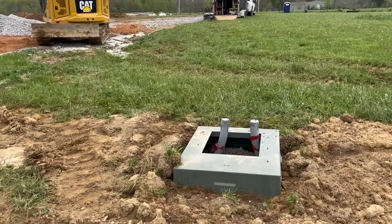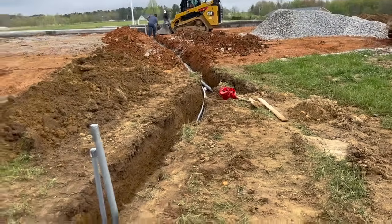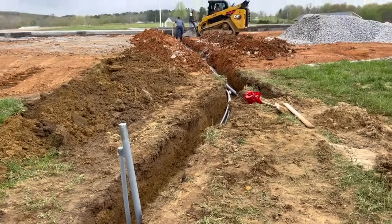Oh, and I almost forgot, the pipe from the transformer going to the home. I also ran pipe out of the house and into the field and capped it off for the future, if I wanted to run any additional electrical. If I wanted to put a barn or something small, I already have the pipe underneath the driveway and wouldn't have to dig anything up.